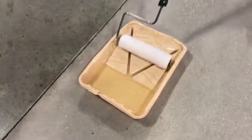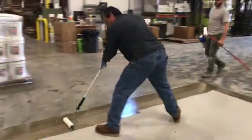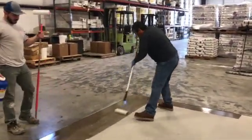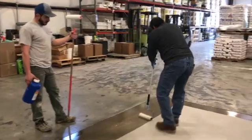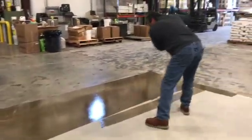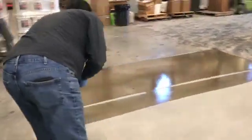The product basically has no odor and looks clear. Now if you did not put a UV light on this, how long would it take this material to tack up? It will not tack up unless there's direct sunlight, which would cause a light film to develop on the surface, but it still wouldn't cure. We back roll this product to make sure that we have a uniform coat. A uniform coat is critical with the UV so that we have no puddles, heavy spots, or light spots.